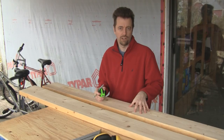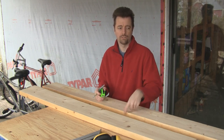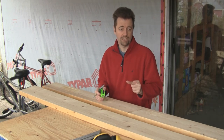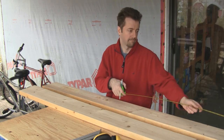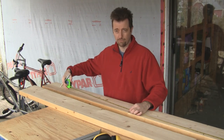For the long sides, using the straight boards, you want to add the thickness of two of the boards to the long measurement of the platform. These boards are an inch and a half thick, so I'm going to add 3 inches to the 75 inches that my platform is and cut these boards at 78 inches. That'll give us a nice overlap in the wood at the ends and provide some strength for reinforcing the bed.